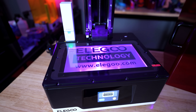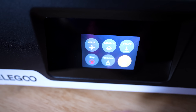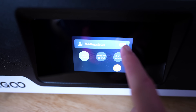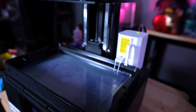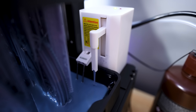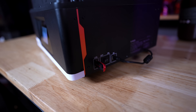The printer has basically the exact same interface we've seen on most Elegoo resin 3D printers; however, there are a few new functions for controlling or enabling and disabling the auto feeding system. When taking the VAT in and out of the printer, you'll need to make sure you're aligning it back with the probe system. One thing to call out is I'm seeing a little bit of resin splashing back up onto the plastic box of the auto feeder.